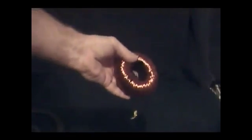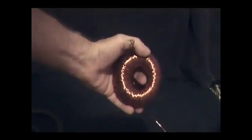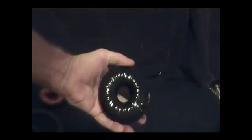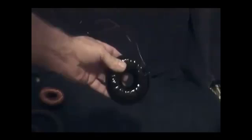This is an example of a smaller current transformer I wound when I was doing some experiments. It can work — it did produce power — but you'd need quite a few more of these wound together or wired together in order to produce a decent amount of power. This is a current transformer I bought on eBay. It was pre-wound and dipped in epoxy. I thought it might be an easy way to do it, but it hasn't really been tuned properly, so I don't recommend just buying pre-wound ones.